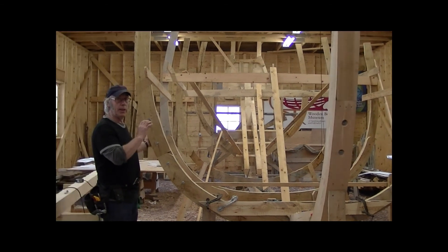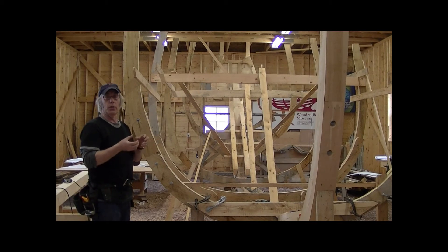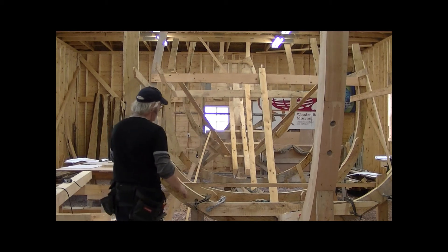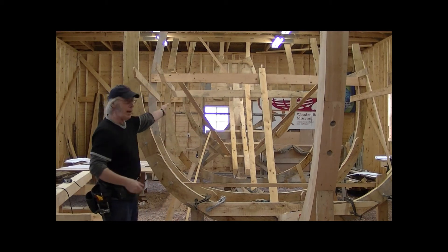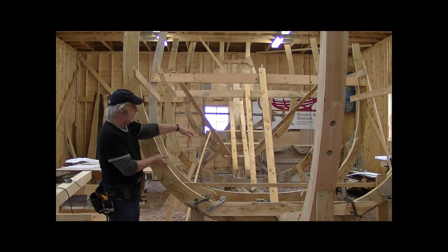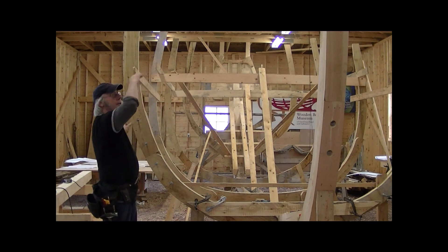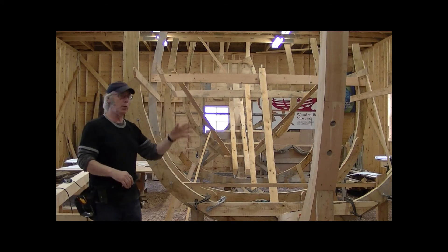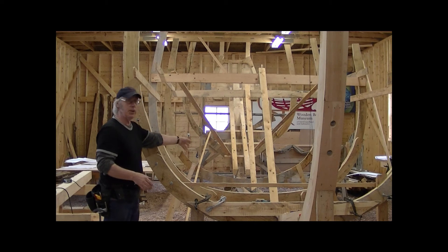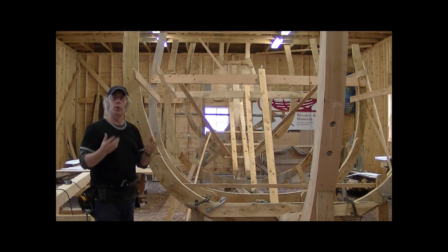The next stage, which we'll see in the next week, is where we start putting the battens — long longitudinal members, a couple inches wide — and they will be nailed from the stem onto the forehook, midship bend, and so on, until it passes back to the counter. They will be like planks; basically, they give the shape. The boat builders would have all these battens put out in various places and would fill in between the stem and the forehook, then between the forehook and the midship bend, and so on. That's the stage we're at — all the main members are in place, and next week we'll be looking at the battens.